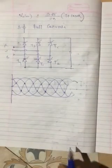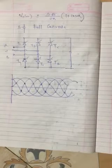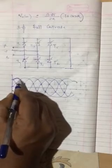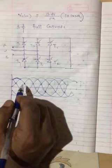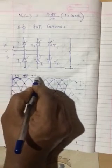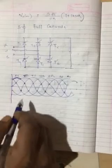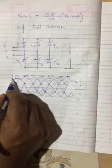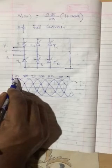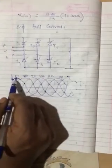This is the phase voltage. Now how does it operate? This is a three-phase converter and we are having supply phase voltages R, Y, and B as shown in the waveform. If we are giving firing pulses at α = 30°, this is α = 0. I will call the waveforms RY, RB, then YB, then YR, BR, BY, RY. When I say RY, they are at this point — this point is α = 0. So 30 degrees means the output will start from here. T1 and T6 are on, so we are getting RY.